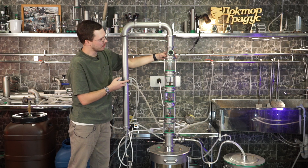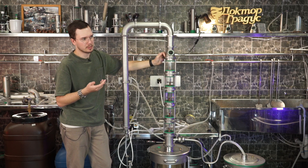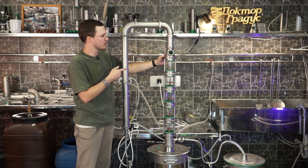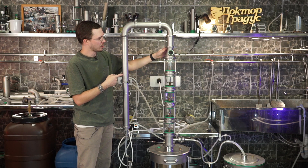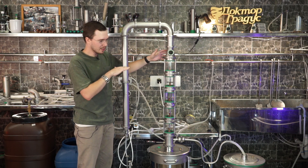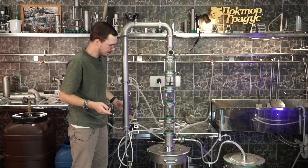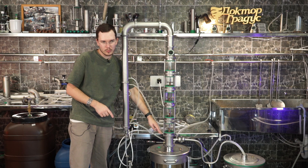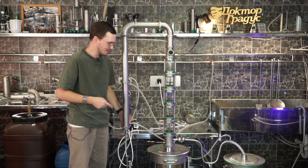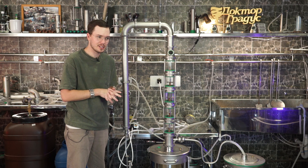The feeding unit as I mentioned. Then I installed a reducer with the side glass to see what's going on — it's actually from the Torpedo 2-inch reducer with side glass. It's not really needed, but I had it on hand so I installed it. It also makes the column a little bit lower so it fits in the camera viewfinder. Then I have the continuous column plates. Down here I have a siphon unit which is experimental — I'm just trying to figure out if it's good or not. Today is also a testing day for this unit.